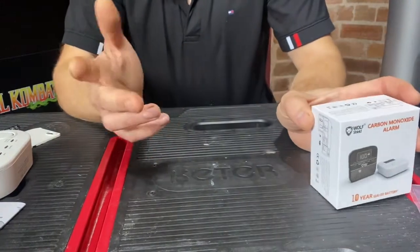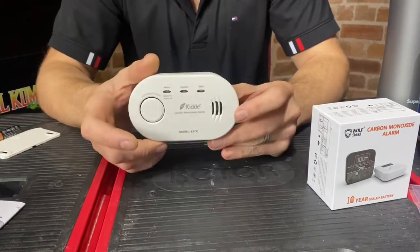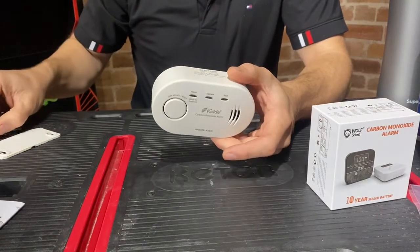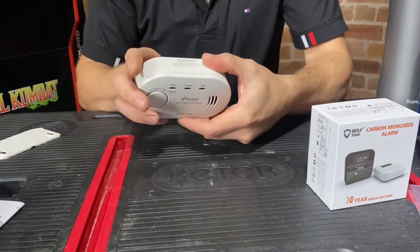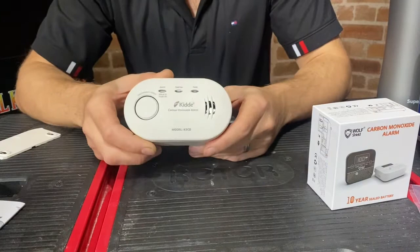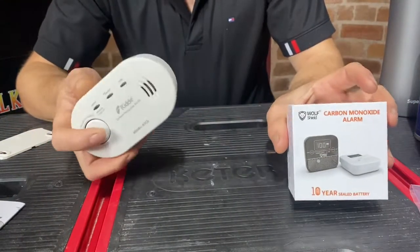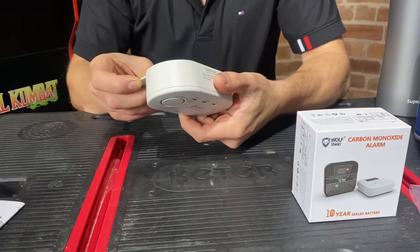We can also test them. When I do my landlord safety checks, my CP12s, you go around with your tick boxes — have they got a carbon monoxide alarm, does it work? What we do is press the button and go 'yes it works, it's in date, that's fine.' But we're not actually testing the actual sensor itself when we do that. We're testing the buzzer, the circuit, and the battery, basically. When we press the button, that's all we're testing — not the sensor itself. Similarly, if all you're doing is pressing the button, hoping it buzzes and checking the date, then that's all you're doing.